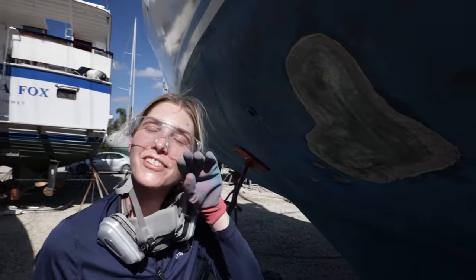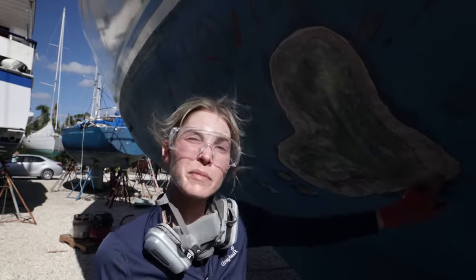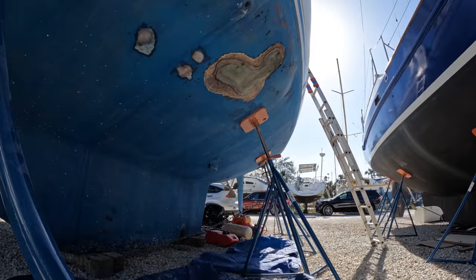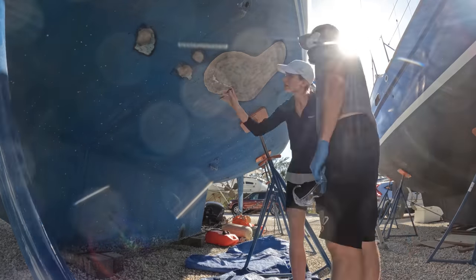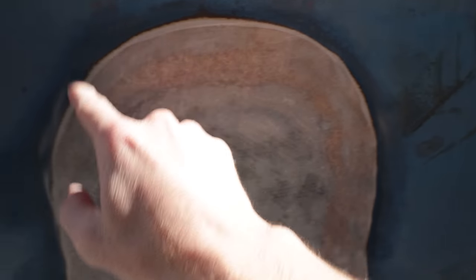Last night we hit a rather frustrating stopping point, so today I am back to sanding. We are creating a larger perimeter so that we can lay our last big piece of glass and fill in with a couple of smaller pieces as well. We alternated today — Kirsten let me have some fun with the power tools. We expanded around every edge so the most recent layer of fiberglass has at least an inch in every direction, and we knocked down from the peak.